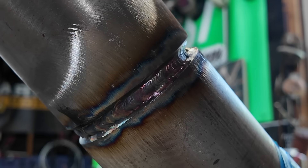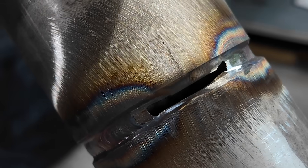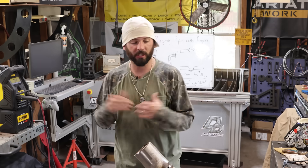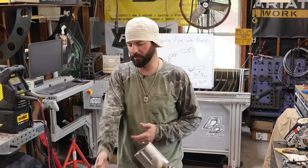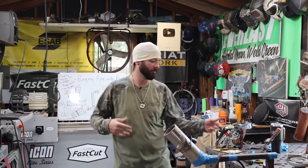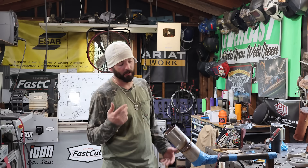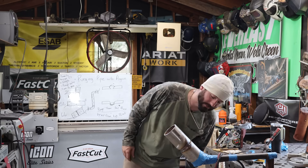The main point of this video is not necessarily to show you how to put in a stainless steel root, but to show you how to properly purge and tack it and feather your tacks. I'm going to go ahead and cut the purge now. Maybe we were cutting a tack off and air from the grinder pushed in there and we lit up and started welding — that could give you sugar. Maybe the purge stopped, the hose fell out, or a hole happened. Something caused us to lose our purge, and I want to show you what that looks like on this last little bit.